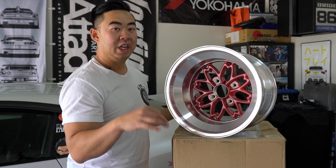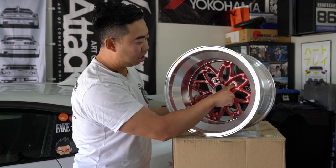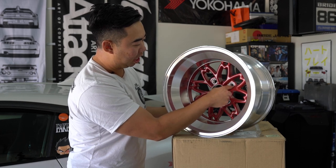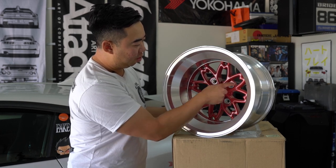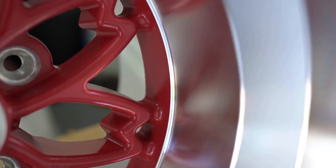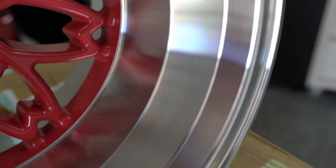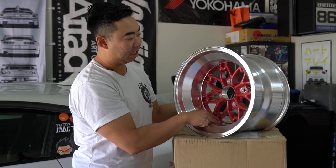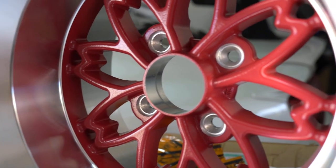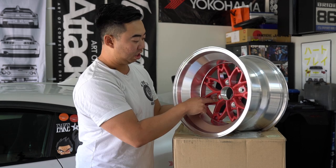The aluminum on the 15-inch is machined out. The original 14-inch sand cast version actually required a steel insert to ensure strength for the lug nuts, but here on the die cast, it's just bare aluminum for mounting lug nuts. The mounting points are embedded inside the flower petals, keeping it very clean. The lip is nicely machined and polished on the edge with a clear coat, giving it an iridescent look. It definitely looks like a two-piece style wheel even though it's one piece. The center has a dimpled effect resembling the sand cast method seen on vintage wheels like Watanabe, which they chose to keep on this die cast version to complete the vintage look.